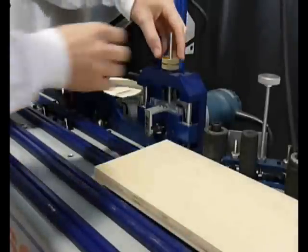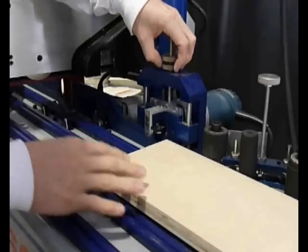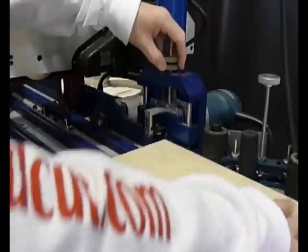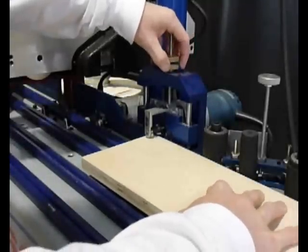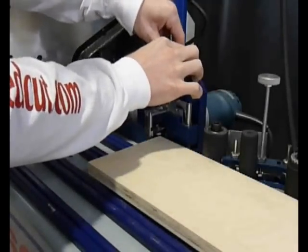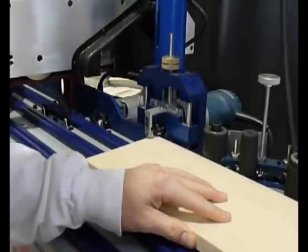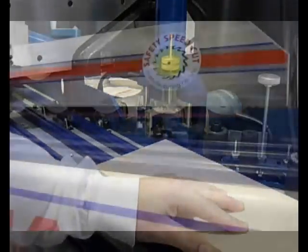You'll see that it's not lifting up. So Steve will turn the knurled jam nuts and adjust it until the correct height is achieved, then lock the jam nuts to secure the setting. You'll now notice that the router moves up just slightly — that is the proper position.